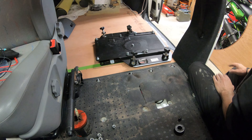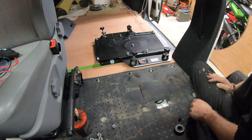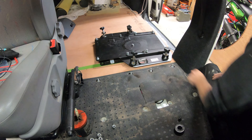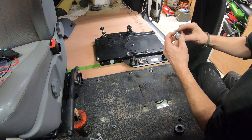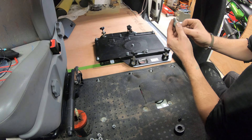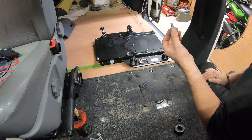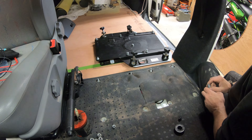I've already prepped so you're a little bit ahead of the game. You've got eight bolts — you can see four here and there's four holes here — because what I've done is I've removed the bolts. As the swivel moves it hits on the top of the bolt, so you have to remove literally just until the thread. I took that off and cut it off with a hacksaw or an angle grinder, fettled the edge, and it's ready to go back in.